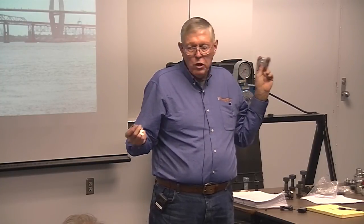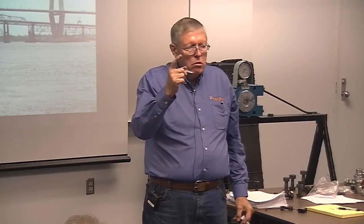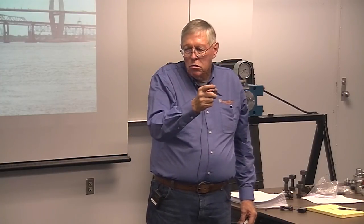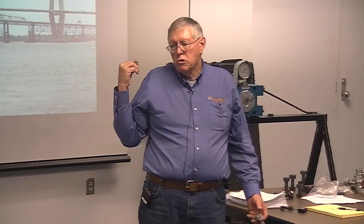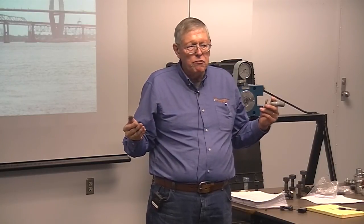Can we live with it? Do we have to replace all of them? We don't need to replace them. Pull one bolt out. What tension? Check the torque on that bolt. Take it out, put it in the Skidmore, take it up to the same torque. What's the tension on it? It's going to be the same as what it was in the steel on that DTI. So we're at 52 kips, 53 kips.